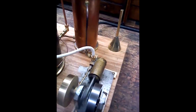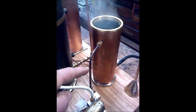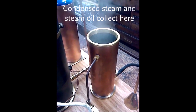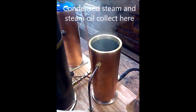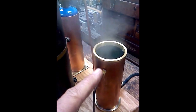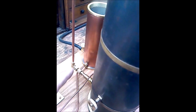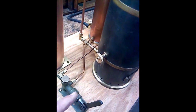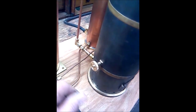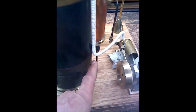The engine is running. The exhaust runs up and then into this collector, and the steam comes out of the top of the collector. This is also the water reservoir, and the water is directed from here into this little hand pump and is pumped through this small line into the bottom of the boiler where it's heated.